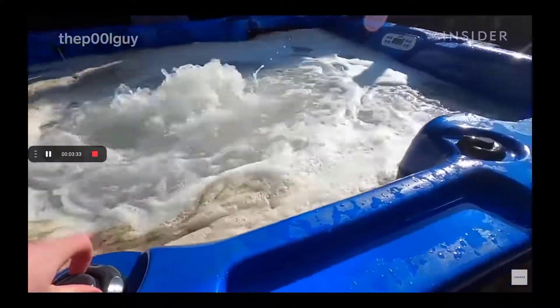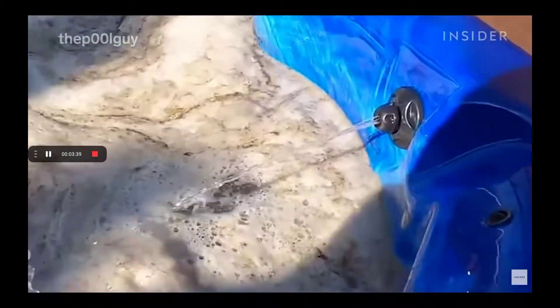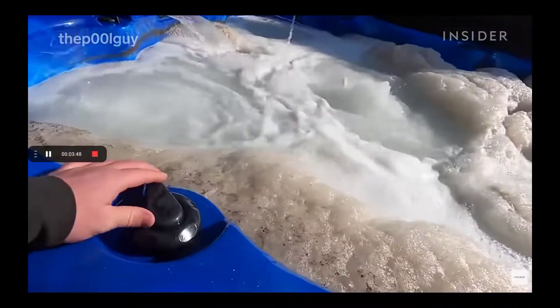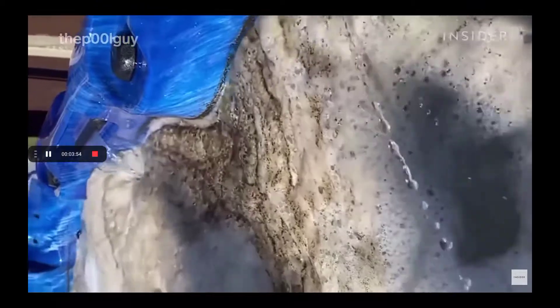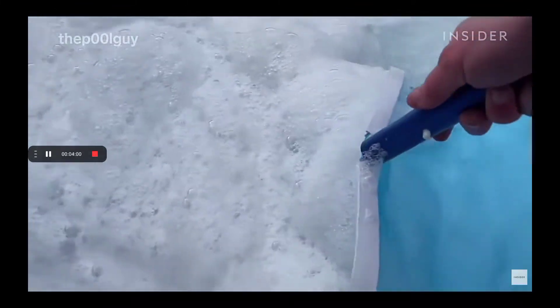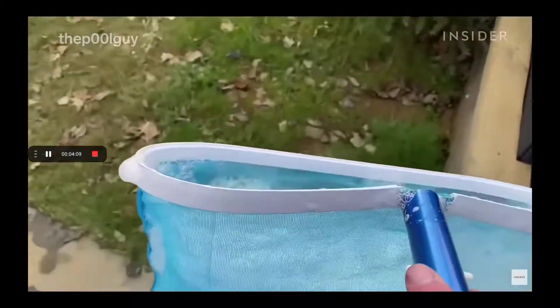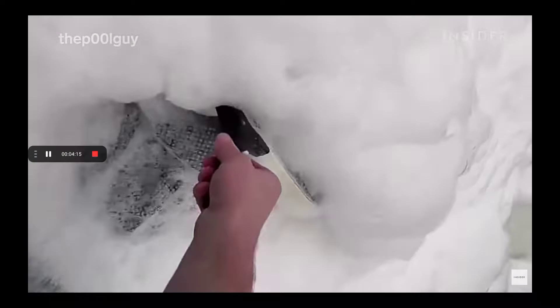It starts reacting — it's clean. In the tubes inside the hot tub it creates like a foam, and you can see the dirt coming out of the pipes as well. You can see it's working. Once it foams up, you can get a net and just net them out — what happens is it will start sticking to the sides because it's like an acrylic material. So if you don't scoop it out you'll have to scrub the sides again. It's just easier to get the net, net out the foam bits and all the dirt on the foam.